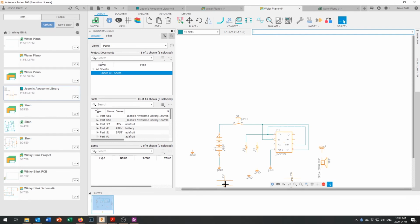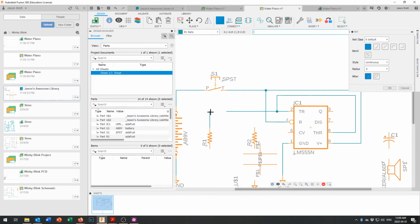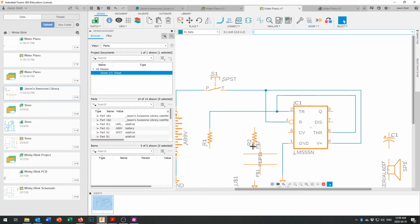Here's our strangely huge capacitors. Oh, they're taking up so much space. Bad capacitor design. Let's bring this out over here a little bit and try not to have, I'm just going to delete that for a second because it's easier to redraw a net right in here, and we try not to have angled or strange nets happening right when we're drawing the schematic. It's fine on the printed circuit board, but on the schematic we try to keep things reasonably neat and tidy.